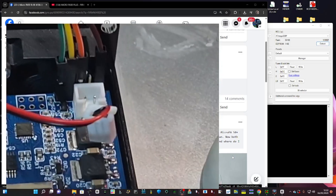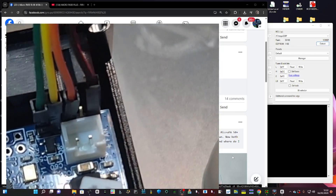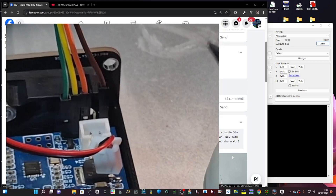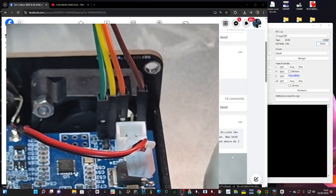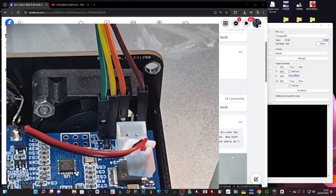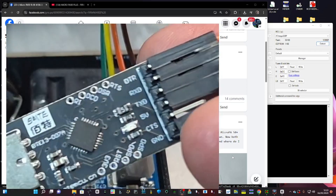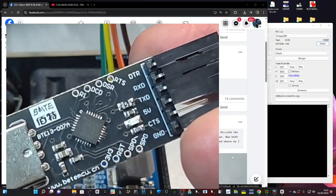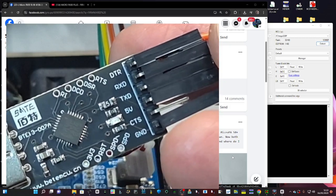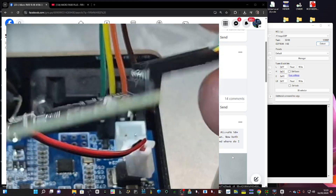Look at the adapter I'm using — it's right at the back by the fan. Just copy my colors. You can buy those GPIO-type cables on Amazon for just a few pounds. The actual adapter you need — this is crucial — needs to have DTR, RXD, TXD, the five volt, and then you skip CTS. You're not using that. Then the ground — my wire is brown, but it's better to use black.